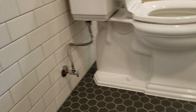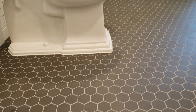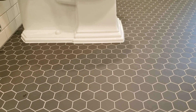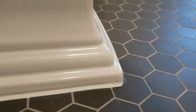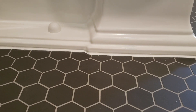The last one is the toilet — it's a Kohler, and I love Kohler, but this was a challenge. We took pictures before installing it. We had it planted down in the back so it was nice and flat, but from the front seam up it was about a half inch off the floor. That's not right, so we pulled it back up, got some more wax rings, and reset it.